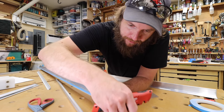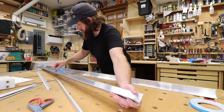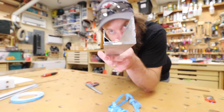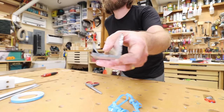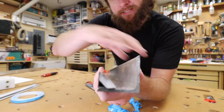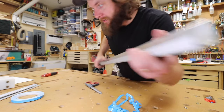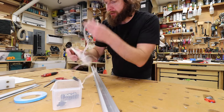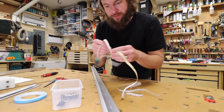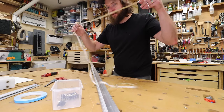The back part is supported. I'm going to try and peel off the top part. The LEDs will go here. This part will actually reflect back some of the light onto the books, but the light will generally be going up towards the ceiling. I want to know for each strip how much current is drawn, because that will affect my power supply decisions that are coming up very soon.